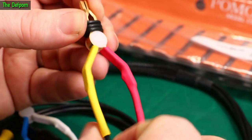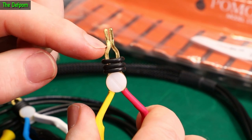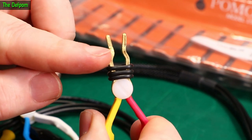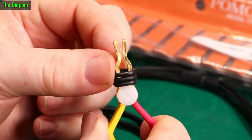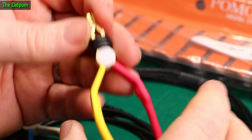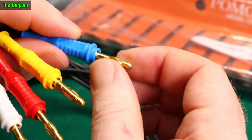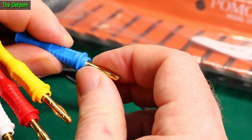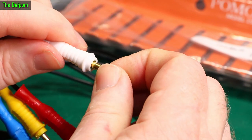What I'm not sure I like is that the clip isn't closing all the way — the tips are not touching. They've been over-formed, so the further apart you go the more things will want to slip off. I'm inclined to squeeze those up and flatten them to be more parallel. The gold-plated banana plugs though are nice and tight — a good fit on there. Sometimes you get cheap ones that just spin freely, which can cause contact resistance problems. These are nice and snug.